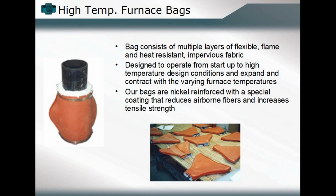And as we talked about in the beginning, one of the major benefits that you find in the fabric expansion joint elements is that you can make those transitions, maybe pretty drastic transitions in terms of the profile of that belting material, in a relatively short space. If we take a look primarily at the lower photo, you see that you have a large diameter inlet and a very small diameter outlet, relatively speaking, over the length of that fabric expansion joint component.